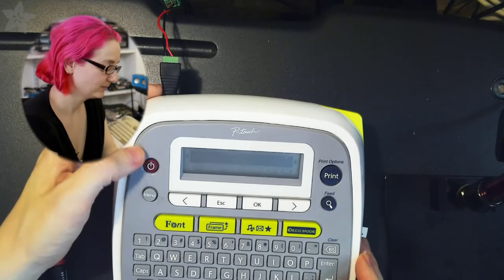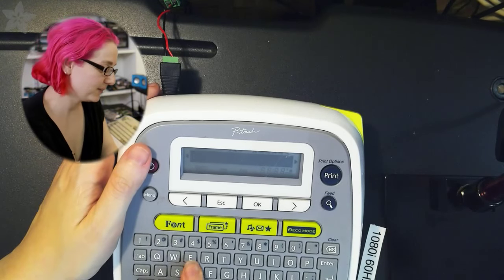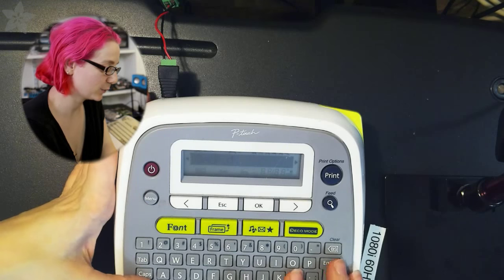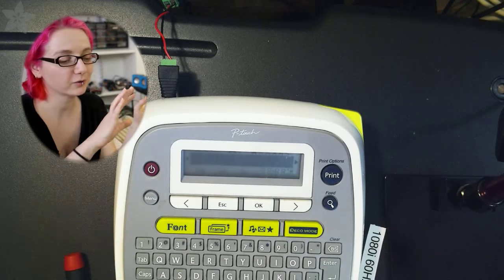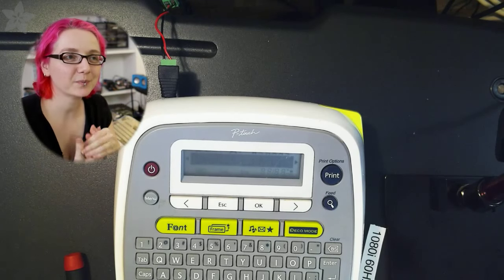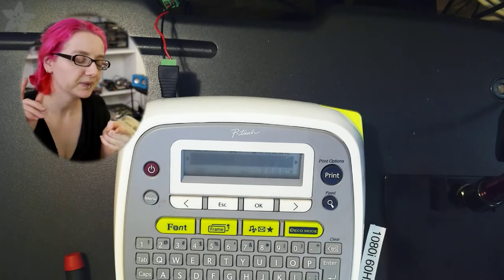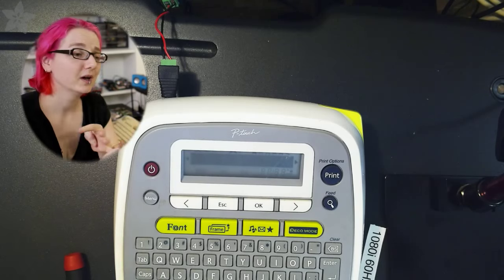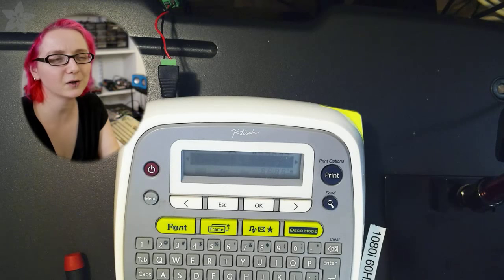All right. And then if one of the components were not working on the green double-sided PCB, how would we find the problem? Oh boy, that's a tough one. I don't know, because it depends on what it is. So without making super 100% blame-me-later general statements, pretty much any time something breaks, it's the power connector or the fuse, or a power regulator. It's almost always the power supply: the DC jack is the wrong size, the wrong polarity, something's cracked, a fuse, a busted cap. It's just really rare for solid state electronics to break.